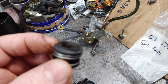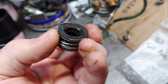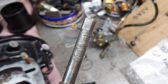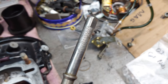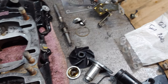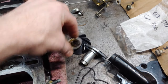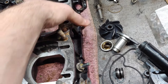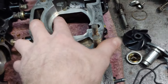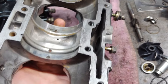A lot of the stuff is good. I took the impeller — the mechanical seals were leaking really bad. This thing is just another piece that's deteriorated. The shaft was kind of pitted in the stereotypical spot, but I'm going to clean that up a little more. The oil sealing surface looks pretty good at this point, so I'll polish that up. I took out the old mechanical seal. The oil seal for the pump is still in there, so I've got to pull that out.